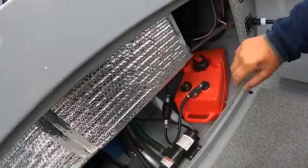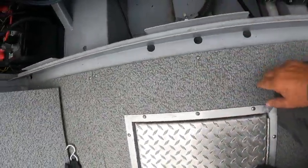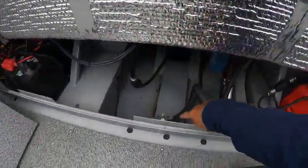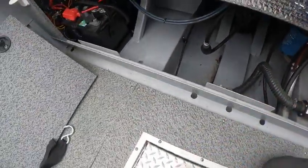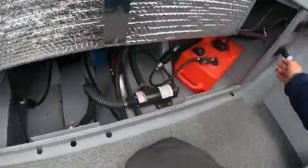That's how you pump out on the macerator if you have scales in it. Say you're at home - I tilt the boat up like this, pull the drain plug, open that valve. That way any water that gets in here is just going to go right out your drain plug instead of having to hold your finger on this.